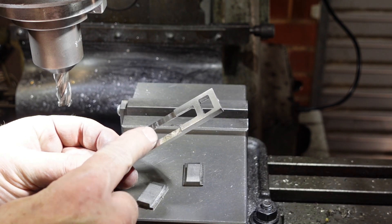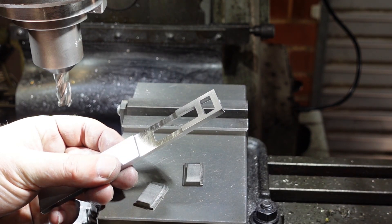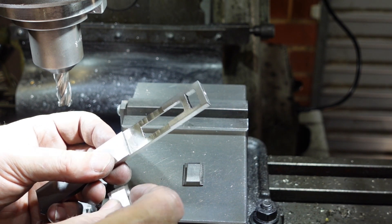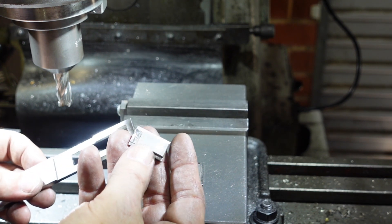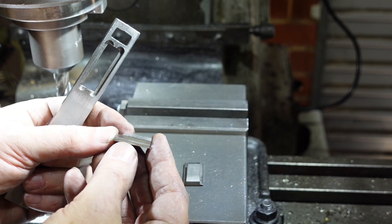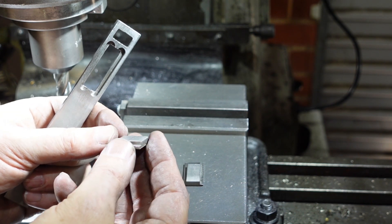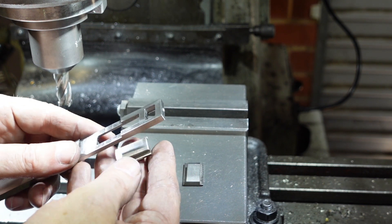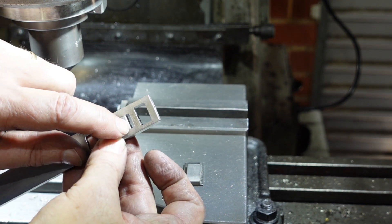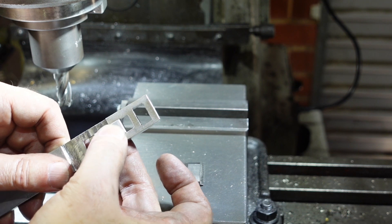I've finished my main pieces and I've filed out the corners. I'm going to have to revisit that for reasons I'll show you in a minute. I've also started on the little clamp pieces. These aren't all that complicated except for hanging on to them — they're a small part, they get machined all over. They fit in here like that, and that's why I need to file out the corners a bit more because they're not quite sliding up and down.